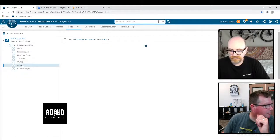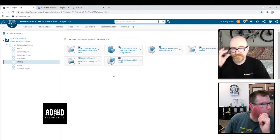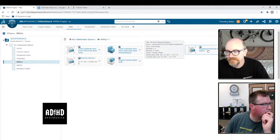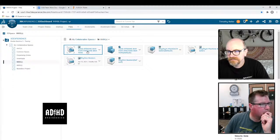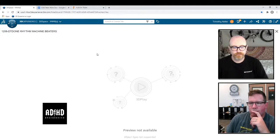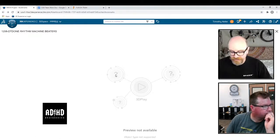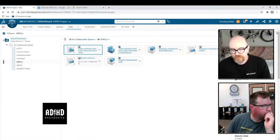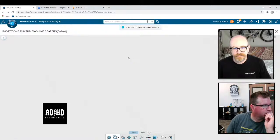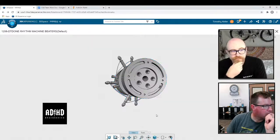I'm talking about taking a model to look at it, to take measurements from it while you make another one. He just did it: you click on Window at the top and then New Window, and it opens up a second instance of SolidWorks. So you run two instances of SolidWorks. You don't want the dual display version or the tiled version. I'm talking about two menu systems, everything doubled, so you can look at one part and design another one without having to switch between them. They're both open natively. I think that's the best way personally.